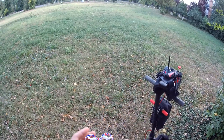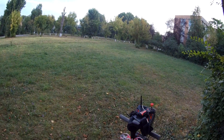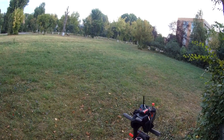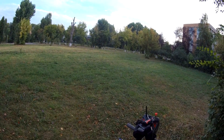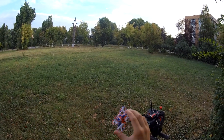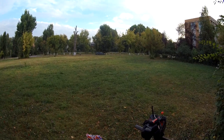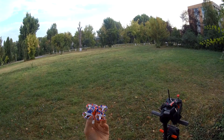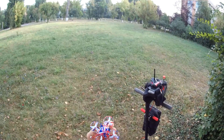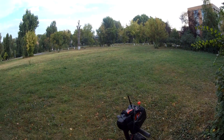Now it's time to pack it up and use another battery indoors to see how this thing works inside. I'm still going to fly it line of sight. I really like how this thing maneuvers — it's very predictable, not extremely fast, and it's rather locked in. It won't wobble too much or drift to either side too much. This is running just as it is out of the box — no PIDs, no other settings, nothing. I didn't even calibrate the gyro. I just bound it to the transmitter, set up my channels and flight modes, the arm switch, and nothing else.